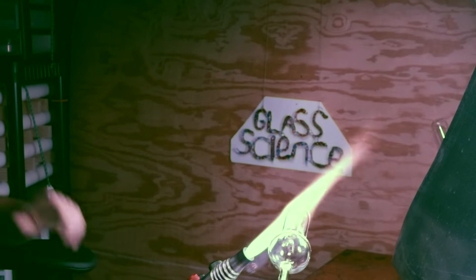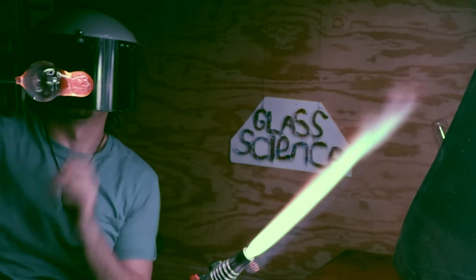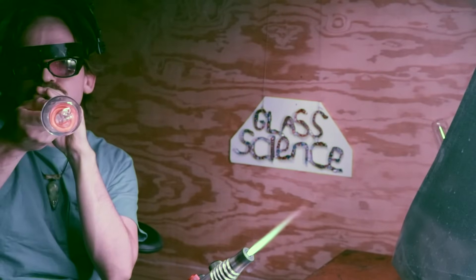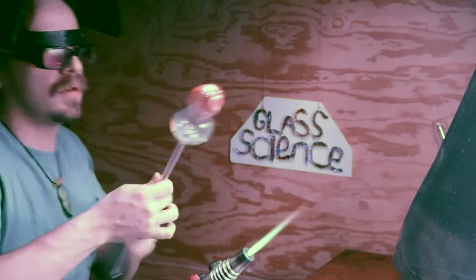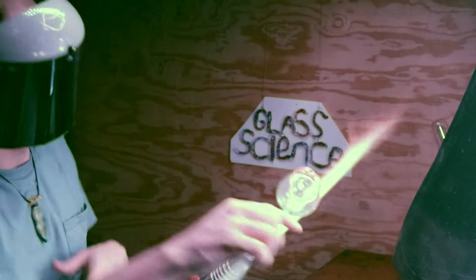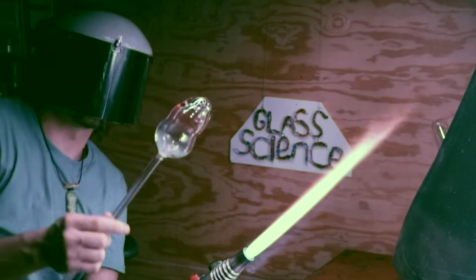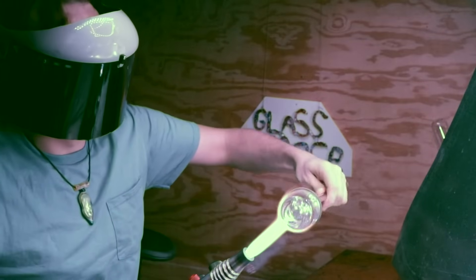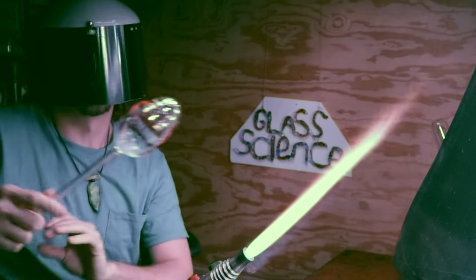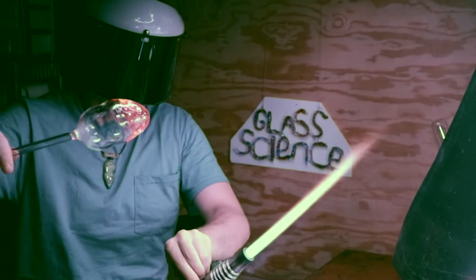I'll give the end a little puff to even out the walls before turning up the heat to blow out the next sphere. I let it radiate a few seconds before puffing into it — that really helps even out the heat before the puff. With that end section puffed out, I'm going to puff out the middle section. I wouldn't have been able to do this on one blow tube, because as that end condensed up it would get heavy and slump down — that's why I've been rotating the blow tubes from front to back and puffing it out in multiple sections.